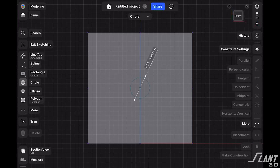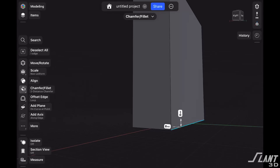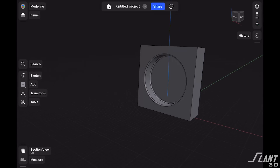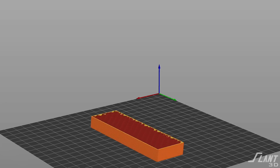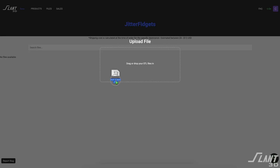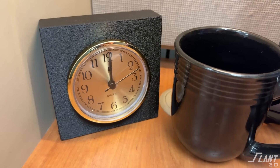You can start out with something very simple like this very monolithic brick. We designed it to be a straight brick but added a slight angle at the bottom. This allows the clock to face slightly upward, improving its appearance, and also improves printability because the interior channel no longer has any horizontal overhangs that would cause sagging. There's no need for supports or special features, so it can be uploaded immediately and reliably with confidence the part will come out well.